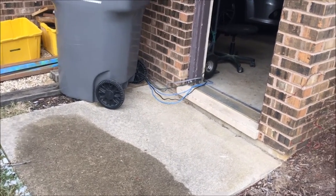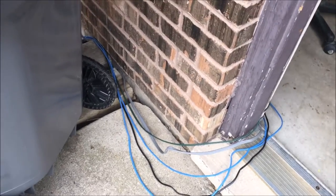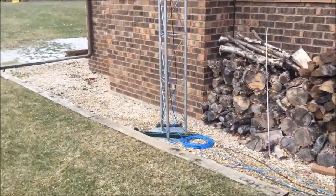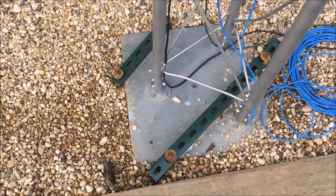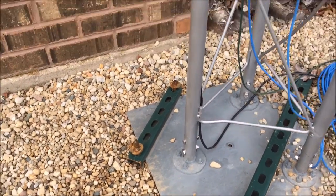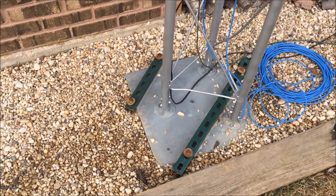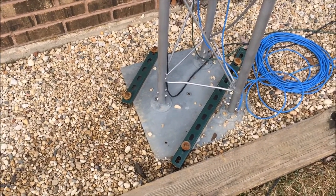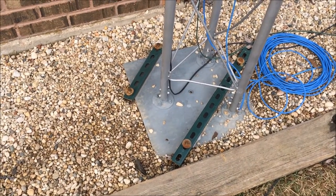Coming out of the garage from my computer is a couple of Cat5s, a power cord, and a piece of Romex for my play set which hangs in the doorway. It comes along here and over to the base of the radio tower. For year one I went basic with the anchor — a steel plate I made with some stubs sticking up, and the base of the tower is bolted to those stubs. I have Unistrut spanning across the top of the steel plate, staked into the ground. I drove stakes right along the sides of the plate to hold it from sliding side to side — this thing won't lift out of the ground, it's more likely to kick, so the stakes are in place to keep it from moving horizontally.